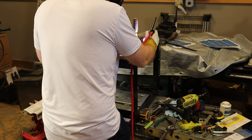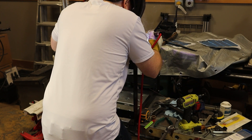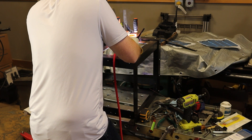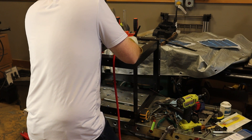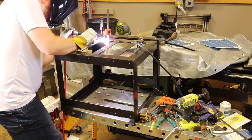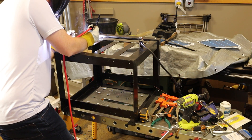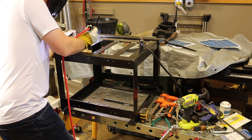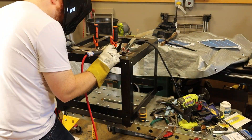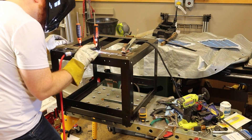This video is going to be shorter than my typical video since I'm mostly repeating what I've done from the previous episodes. I'm using a Vulcan ProTig 205 welder set to 120 amps, using a 3/32nd of an inch TIG electrode and pure argon gas at about 15 cubic feet per hour. My position is a bit awkward for most of these welds because I have to stand and hit the foot pedal and I don't have a lot of arm support, but I'm doing my best to make it work.